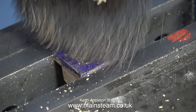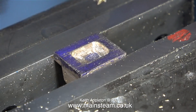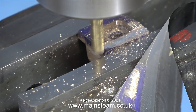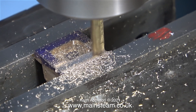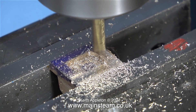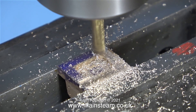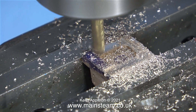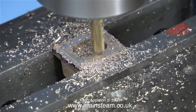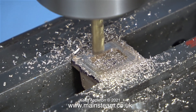To get through the job in a reasonable time, the clips are running at about eight times normal speed. I only return the speed to normal for the sequence using the paintbrush and to show the progress. The recess is now complete. Now it's time to mill the top surface of the valve — I'm trying always to cut in the direction of rotation of the cutter so the sharpest edge does all the work, and in no time at all I have an almost completed slide valve.